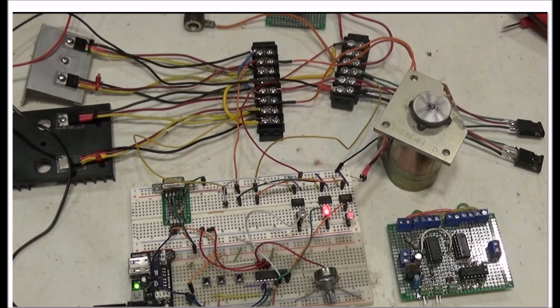Let's get into this. If anybody's seen my earlier videos, you will recognize this board in the lower right-hand corner. It has a TTL input that interfaces to two CMOS CD4011s, and they were used to drive these MOSFETs to form an H-bridge motor control. We were struggling with problems like how to cut on various MOSFETs, which required a higher voltage, and then figuring out how to connect those higher voltage CMOS parts through a TTL part back to our Arduino, or in this series, a PICaxe — it hooks up the same way.